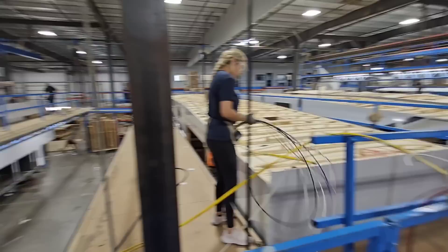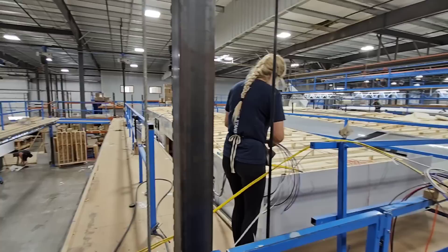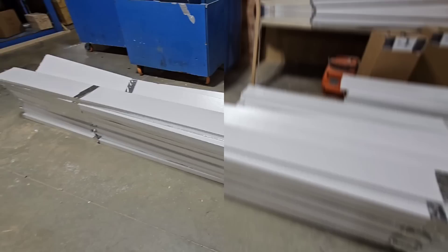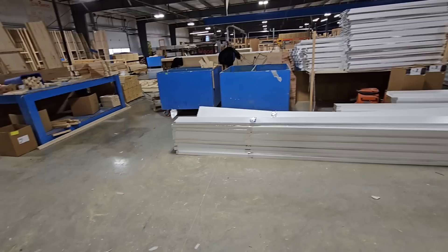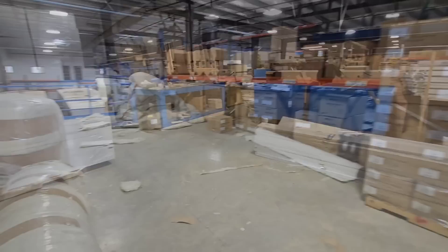I like how everything is being bundled up. A lot of times you just see wires ran and burrowed through something, but here it's all bundled up and taped up real well — takes that extra five seconds to bundle, but that's the quality. Over here you can see some ducting because they try to direct dump all their air in when they can, but bathrooms and other rooms sometimes need air brought in, which is why you see ducting installed.